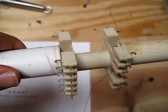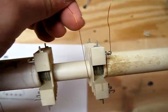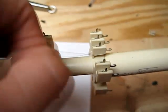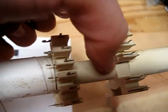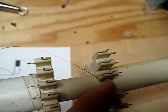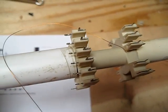This is very important: I'll be winding it in this direction — downward, away from our starting point. When we wind it that way, it's going to form a nice clean tight bend and wrap around here. It's not going to be loose or spanning the winds that come up above. If the wire were at an angle or touching these winds that build up out here, it would arc between there and burn out your transformer.